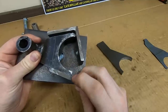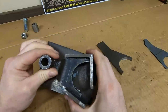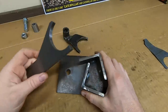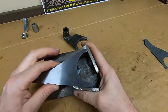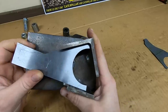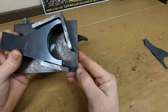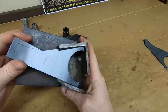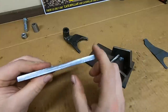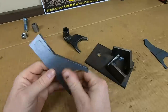I made a mark right where that leg lines. This one bottoms into the inside of that angle, and I needed to get this to be as true a fit as possible to maintain mesh with the collar in the gear. You can see we are settled in, lined right in with the mark on the bottom of that leg — it's a good fit. The milling machine was just some fine tuning along the two sides that are finished thus far.